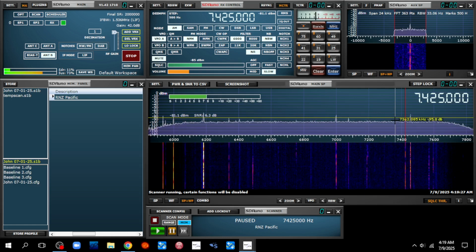So reception is better. So for right now, the way these two antennas are set up, the MLA is doing a better job, less noise. So could it be the USB power adapter that I'm using for the K-480 is introducing that noise? Could that be it? Could it be the location in my yard? Even though it's only 5 feet different than where the other one is, and it's lower, maybe that 2 or 3 feet lower is getting noise. Going to have to experiment with this.